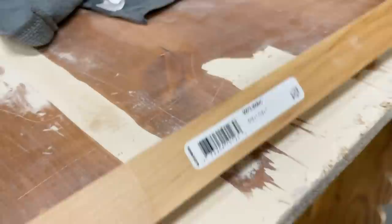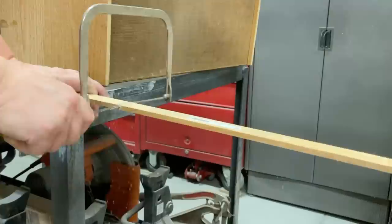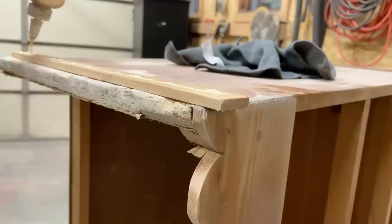I couldn't really get a good surface on the bottom edges of the sides — they were just a little too far gone to fix with wood filler. So I grabbed a piece of trim out of my wood stash to shore up the sides, give me a nice crisp edge on the bottom, and provide some extra support where the particle board had been compromised. I used a little coping saw to quickly make these cuts and then used some wood glue and clamps to attach these extra bits of reinforcement trim along the bottom.